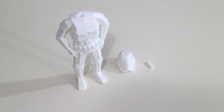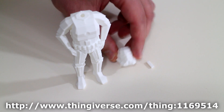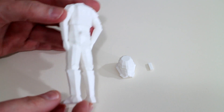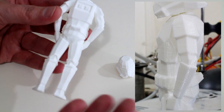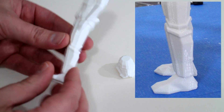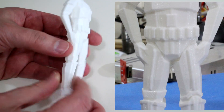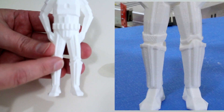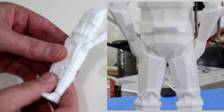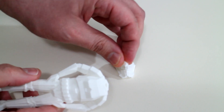And here is the completed low-poly Stormtrooper, available from Thingiverse. It comes in three parts: the body, the head, and the connector. This was printed with the white PLA plastic and as you can tell it's come up absolutely great. The nice gloss finish of this white PLA really shines and really details this part much more than a matte finish white PLA would. I don't see any under-extrusion in any of the layers, so there are no gaps at all anywhere around this piece.